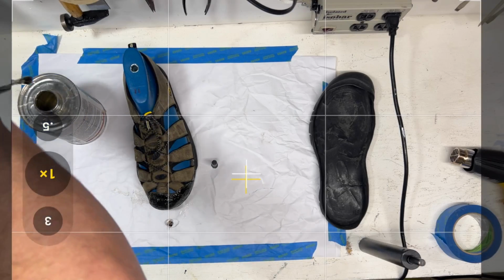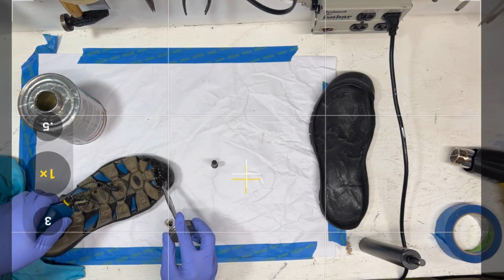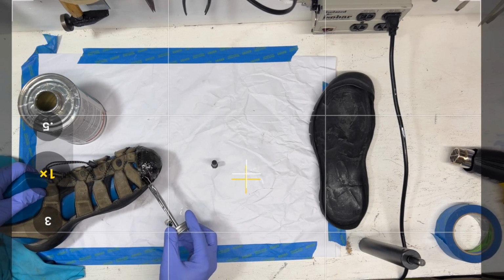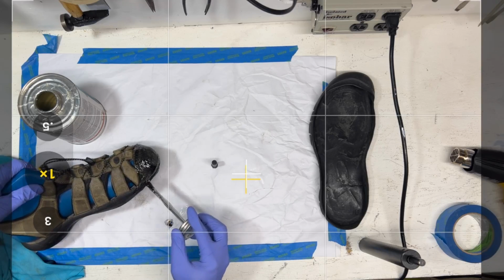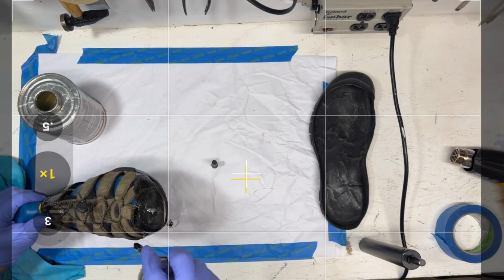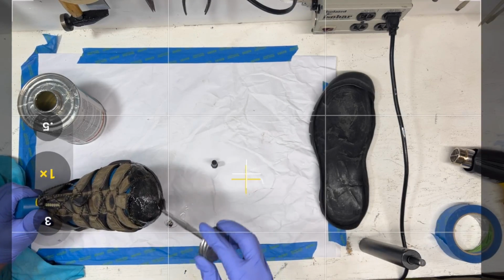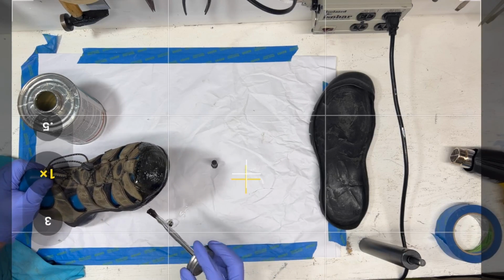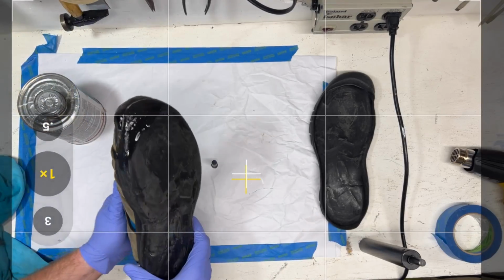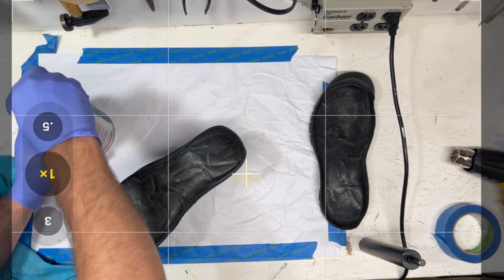So in the shoe factory, you'll see that the parts get a couple layers of primer, right, which is just thinned glue, and then they'll get a couple layers of the actual contact cement. And in between, they'll go through an oven. If you've seen our other presentation where we tour you through a factory, in our basics course or our shoe factory course, you get a good look at the assembly process, and you see that they are actually running the shoes down the conveyor belt, right? And they've got different ovens, right? And we say oven, but really it's more like 100 degrees, just enough to evaporate the solvent, or water.